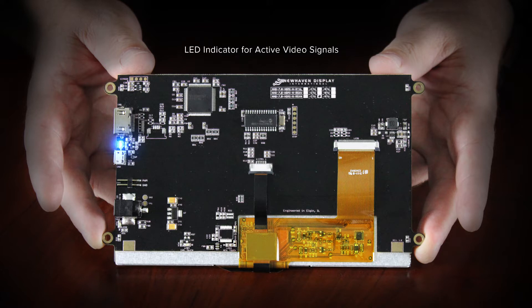This is a blue LED that will illuminate when there is an active video signal detected. And another LED indicator here that will illuminate green when DC power is supplied. The DC jack right next to the indicator is for supplying power to the display module within the range of 5 to 7.5 volts. All models have four 3.5 millimeter mounting holes tooled right into the board, so no extra bracket or casing is required for mounting — just pop in any standard M3 screws.